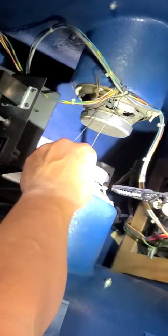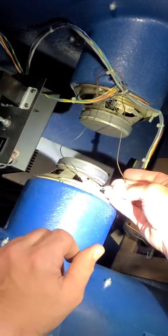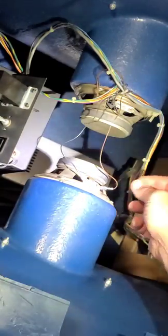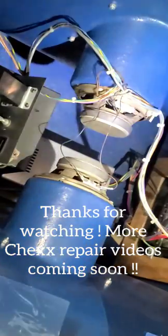Take your old connector off, slap the new one on, and we're good to go. For the other connection, I'll do the same thing — it's got two wires but basically the same process. I'll just splice them, give a little bit of wire on each one, put both of them in there, crimp down, and good to go.